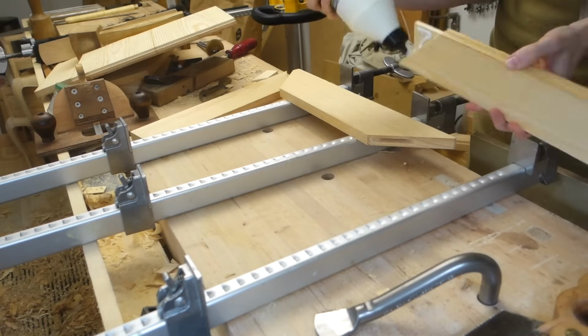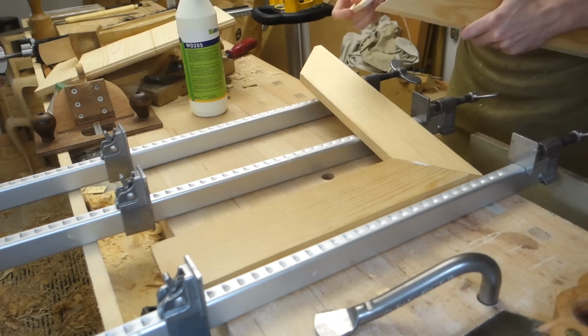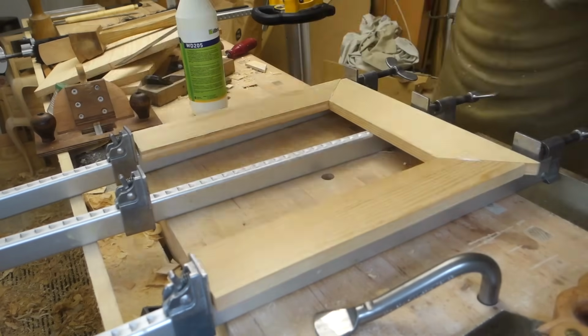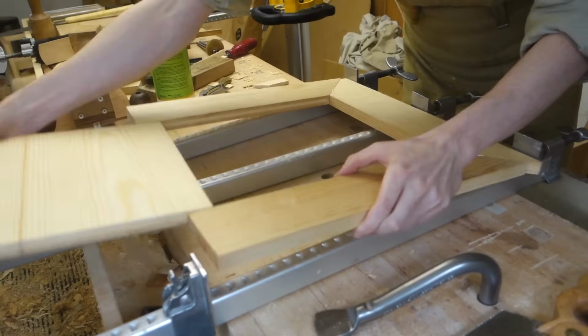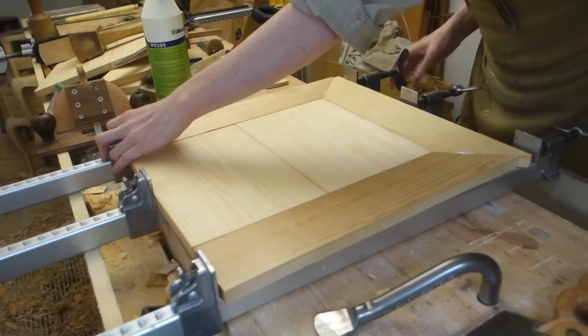With the tongue and grooves fitting, I could glue the tops together. They function a little bit like thick drawer bottoms, being glued at the front and free-floating in the grooved sides to send any wood movement out the back. The tongue and grooves also serve to hold the panels flat once this gets attached to the rest of the tables.